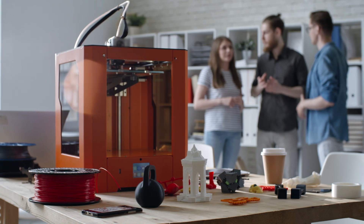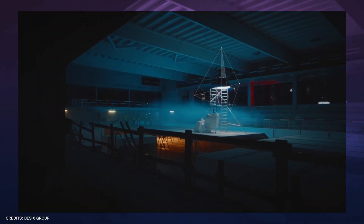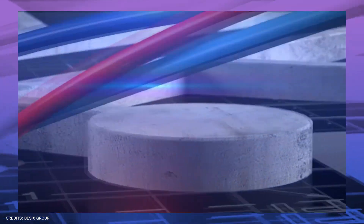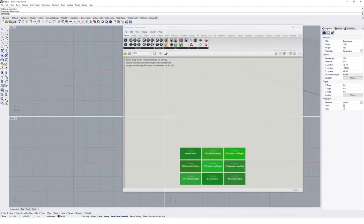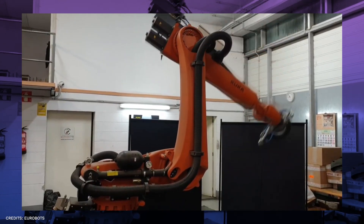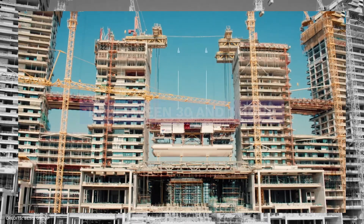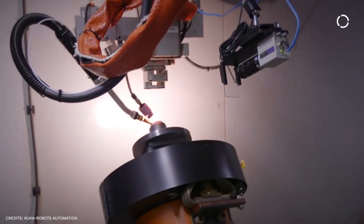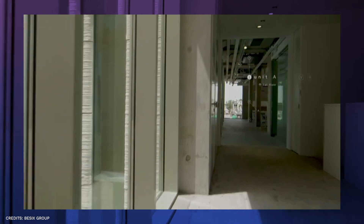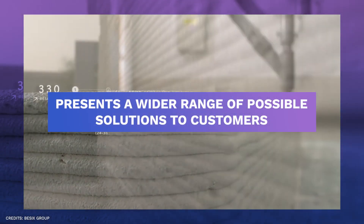Robot-assisted 3D printing is a niche technology, so there aren't many printer manufacturers on the market. The B6 Group is moving forward with the realization of digital projects by utilizing 3D concrete printing. Using the 3D programs Revit and Grasshopper, the B6 Group creates models of each element first. The KUKA KR120R3900 robot is then operated by the software, with a nozzle for printing 3-dimensional concrete. B6 Group can create an object in between 30 minutes and 1 hour — for instance, a 2-meter-tall architectural column may be produced in about an hour.